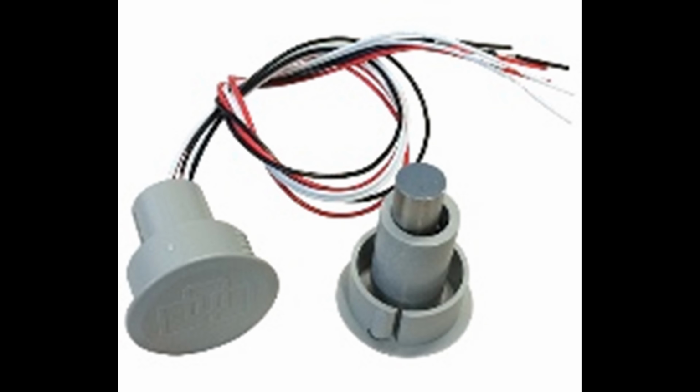Well, like I said, it's just a door chime. It's in a pharmacy. When the door opens, it causes the chime to go off. And you shut the door, it's just a contact switch there. We just mounted it inside the door in the metal frame, then the magnet part in the wooden door itself. And when the door opens, it notifies that someone has entered the pharmacy.